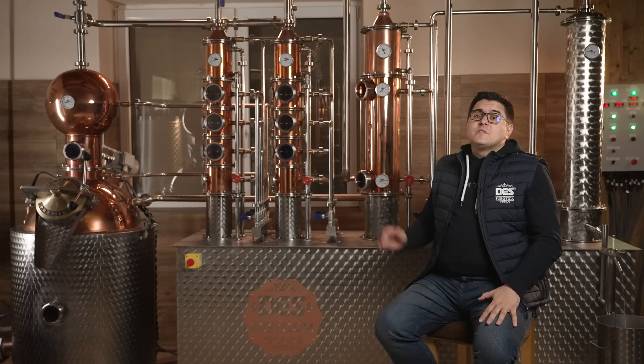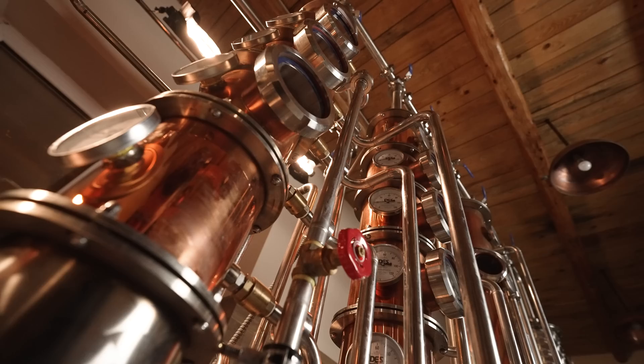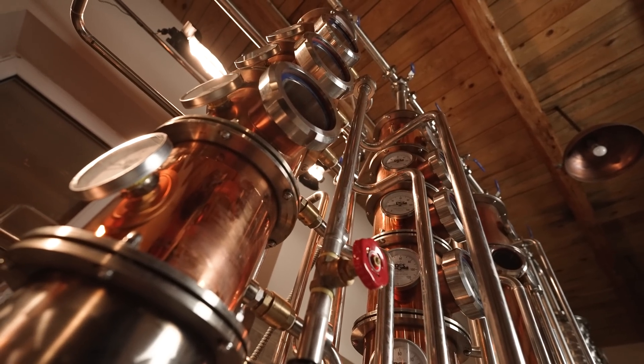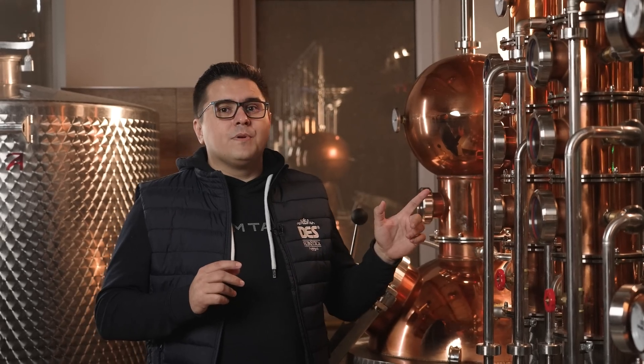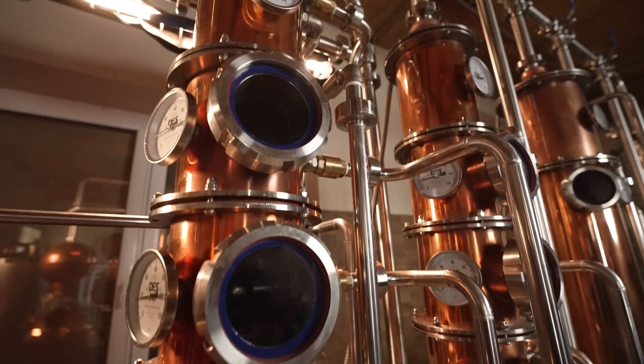The last column is filled with structured pure copper mesh. This enables a large contact surface with copper where the catalytic effect is enhanced, and this column type is suitable for the production of large quantities of the same type of spirit, mostly for liquid and not thick mash with solids.